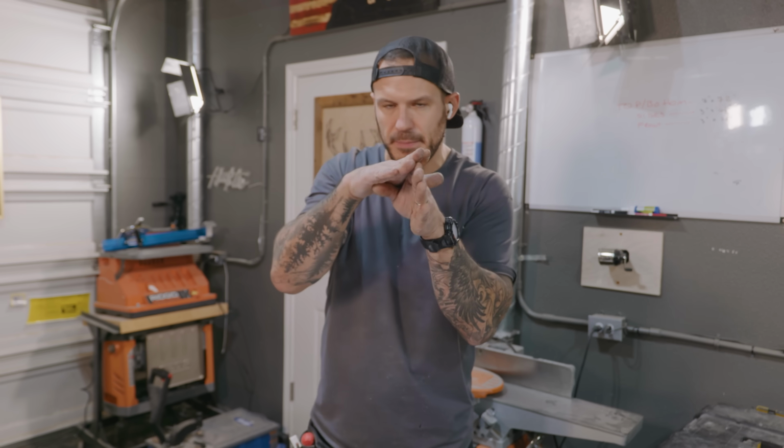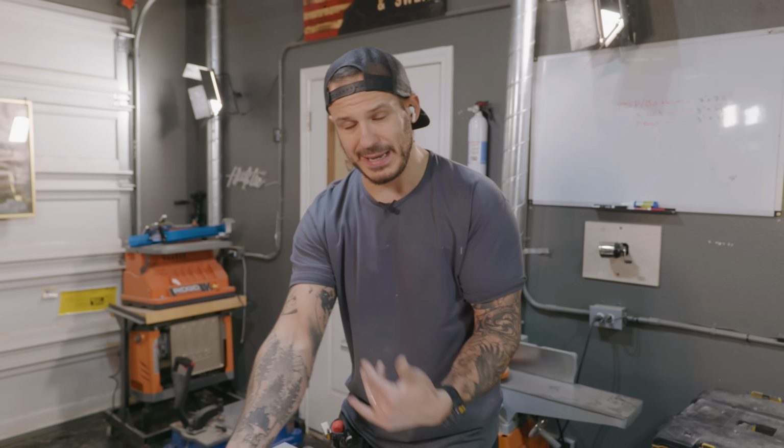As far as dimensions for mitering, it's not as strict as you really think. It's just a little complicated until you figure it out. You measure the overall finished dimensions, the tops, the bottoms. You don't have to account for anything to be butt jointed. The only thing that's different is when you make the cuts, you have to figure out the inside and the outside dimension, depending which way the blade is bending.